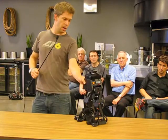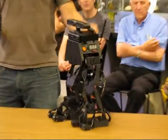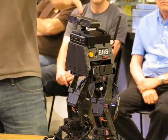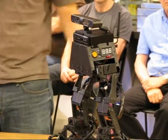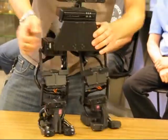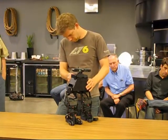I'll give him a demo. He's got a depth camera up top. This is an Atom-based computer up top, 1.6 gigahertz. Right now it's not actually running things — there's a microcontroller underneath that interacts with the motors. But once the whole pipeline gets moved out we'll be doing some computer vision up top. There's a processor on top — it's really just an Atom processor, so it's a full computer.